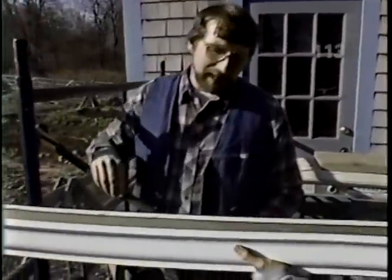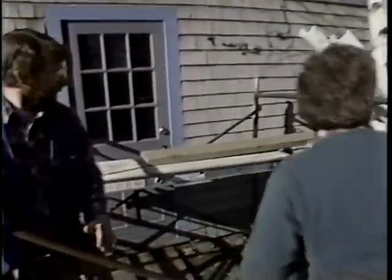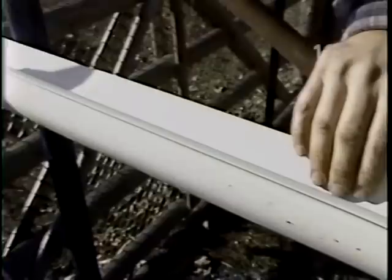That's right. Another choice would be the aluminum gutter. The problem with that is that it's difficult to get good watertight joints, and the seamless variety is not a do-it-yourself job. Right, so we've chosen to go with polyvinyl, a lightweight gutter material, which is easily available at most home improvement centers and can be done by the do-it-yourselfer. How do you get started, Norm?